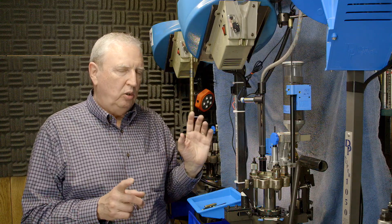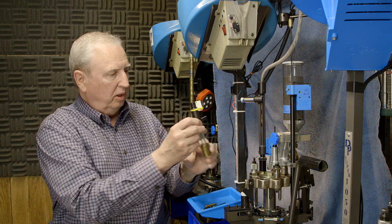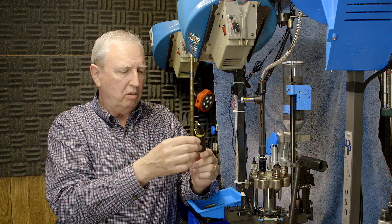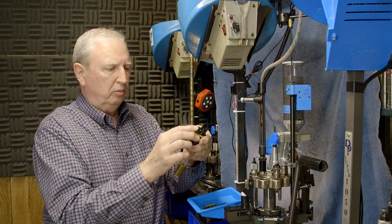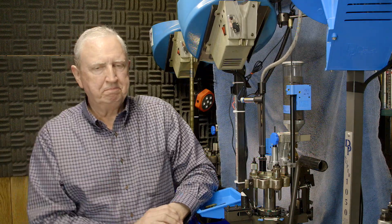A very big deal is that you don't have to modify the MR Bullet Feeder at all — none, zero, nada. The MR Bullet Feeder has this springy wire that comes down and normally connects to this switch — it just plugs on and you can pull it off with your fingers or pliers. Those are the only wires we're using in this circuit. The relay has the same quarter-inch tab connectors, so the MR Bullet Feeder cable just plugs right onto the relay just like it plugged onto the original switch. It's not hard to do at all. Thanks for watching.